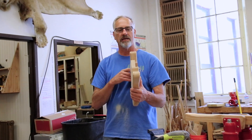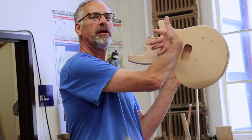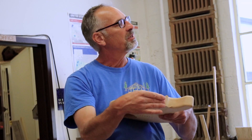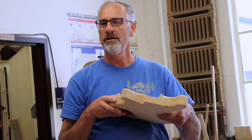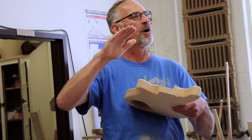By the end of the day when we're ready to put finish on, we've sanded and sculpted the body. In particular, pay attention to these areas we call the end grain — the grain of the wood runs this direction, so this is the end grain. It's the hardest to sand. Look in particular for burn marks from the tooling used to cut this initially. Some of you showed me your headstocks and there were all these burn marks on the side — perfectly smooth, but those burn marks are going to show through with the finish. So we want to get all of those machine burn marks off.